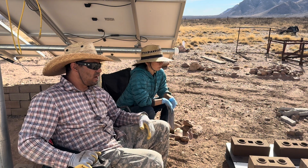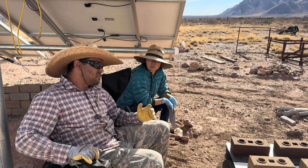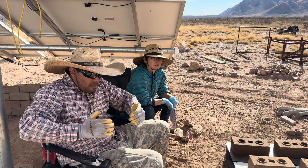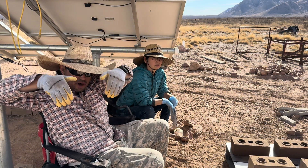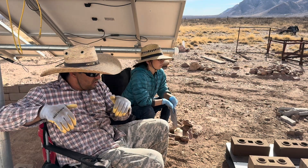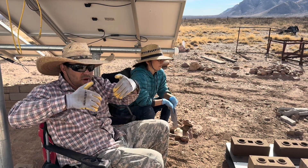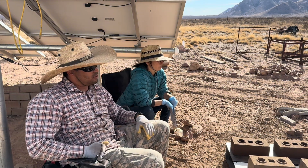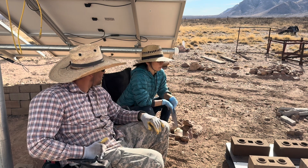I was also going to add that even using the tool, I messed up carrying some of the bricks. When I went to set it down I put my arms straight, and when I put my arms straight I was bending the bricks — causing the top part to compress more than the bottom because I was pushing in on it. Eventually when I do that the brick breaks in half. So there are a few broken bricks again — it's a learning process, learning the art of it.